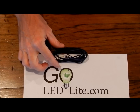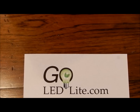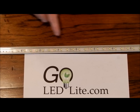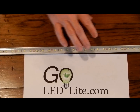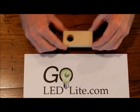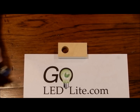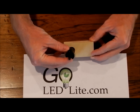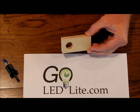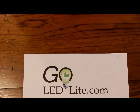You also need some low voltage or bell wire. What we're going to use is a combination of an aluminum extrusion and a Radiance Light Strip — this one we already pre-assembled. You also need a piece of wood. This is where your actual switch is going to mount into, and then this block will mount inside the cabinet to hold the switch in the right location. So those are the basic components.